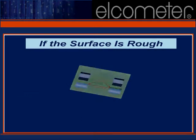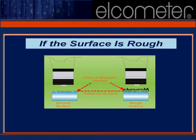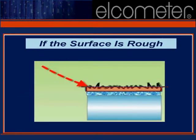The coating thickness gauge actually measures distance. The instrument's probe generates a signal that travels through the coating to the substrate. The distance must be referenced from a starting point or a zero point. The starting point needs to stay constant in order for the coating thickness value to be accurate and reliable.